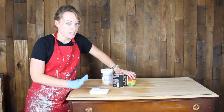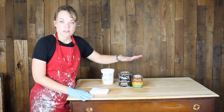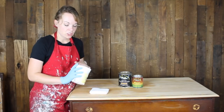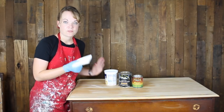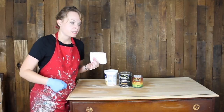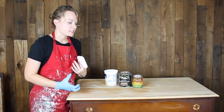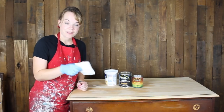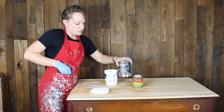I'm going to use my very favorite combination of stain on this piece — a mix of half walnut and half antique oak. These are both water-based wood stains from General Finishes. I just mix them in a little container — save your kitchen containers for things like this — half and half ratio. Then I'm going to use a stain pad for application. There are several ways you can apply stain: a chip brush, a roller, but a rag with water-based stain doesn't work super well because you need to make sure you're getting enough product on there to really even out your finish. The stain pad has been my new favorite tool, and always wear gloves.